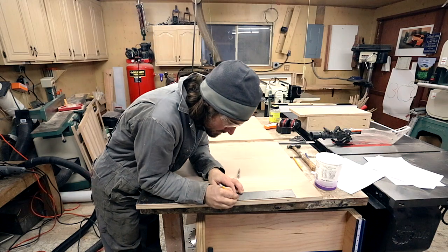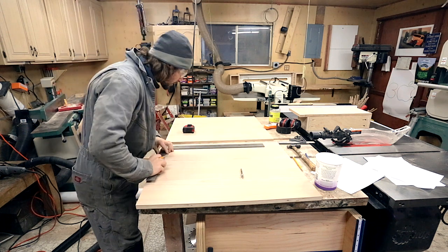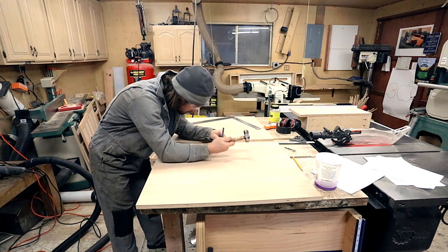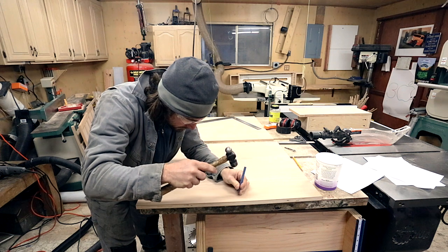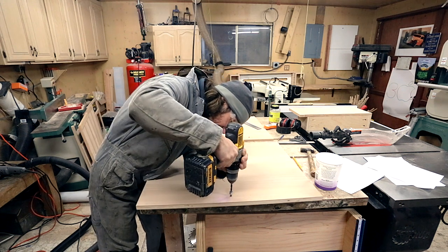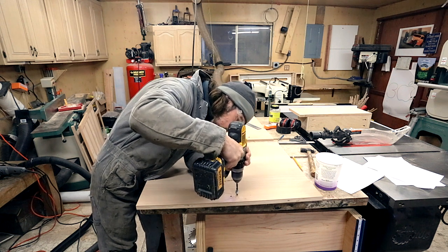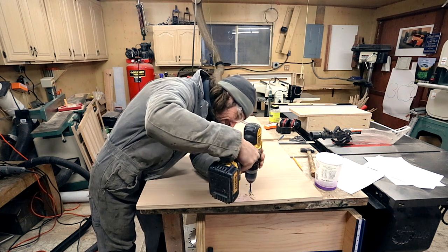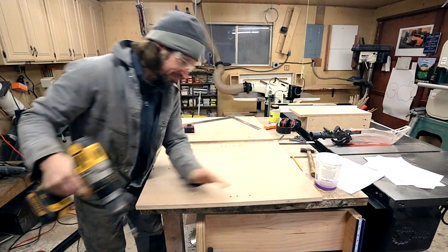Before glue up I usually like to drill out my shelf support holes. I find it pretty easy to simply mark out the location with a ruler or tape measure. I then tap it with a punch or a nail so that the drill will run true. I drill out the holes with a stop collar on the drill bit so I won't drill all the way through the plywood. After drilling the holes I sand the interior with 220, and sometimes I have to hit the rough spots with 150, but good quality plywood needs very little sanding.